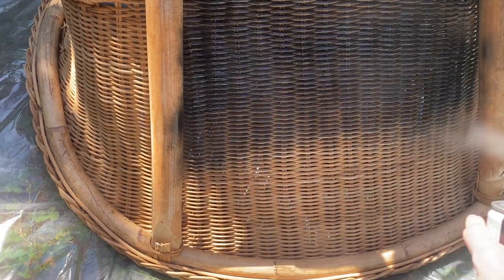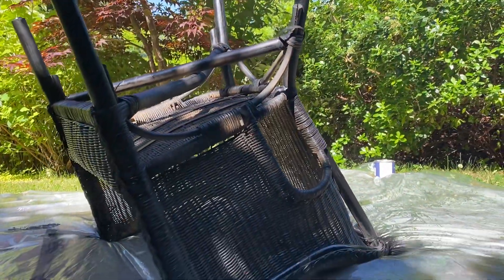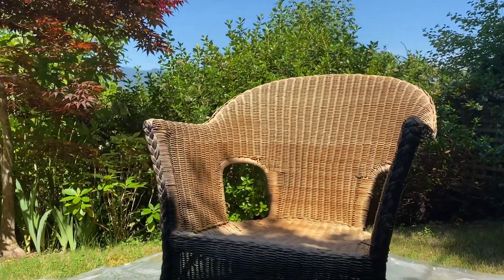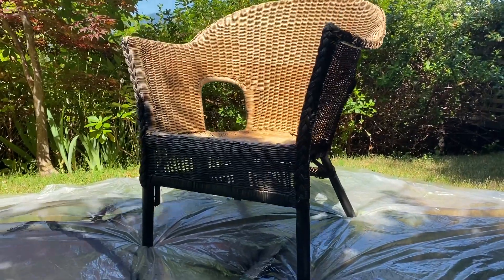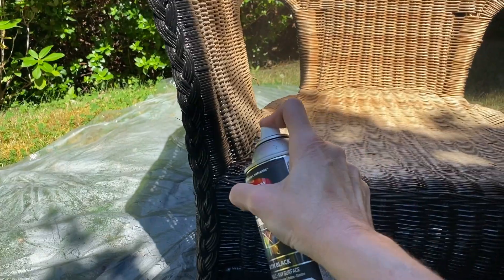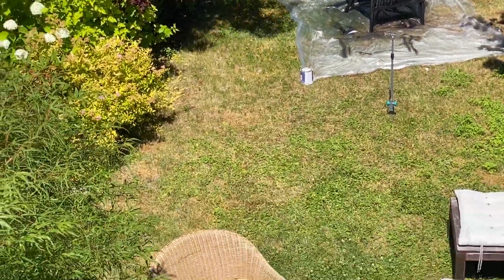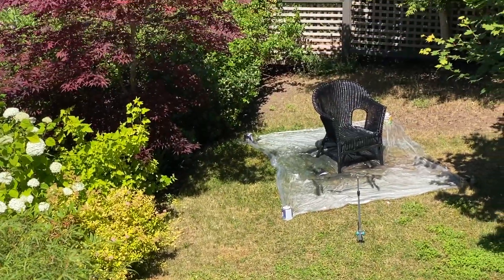I thought by trying the satin finish it might have a nice little sheen, and I'm really curious to see how it's going to turn out. I've seen black rattan sold in that kind of color and I think it actually looks very regal. So if you find these rattan styles but they're not in the greatest condition, this is a great DIY to give it a whole new makeover. Once I completed my underneath layer — my first coat — I just want to let it dry thoroughly before continuing to the second coat. To do two coats on both chairs, it took me three cans of the fusion paint spray. It was a huge bonus to have the paint and the primer in one — you just want to make sure everything is really clean before you start. What an amazing difference between the before and after just with using a spray paint.